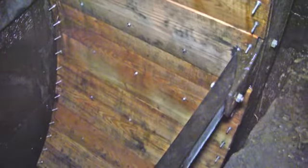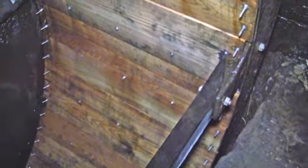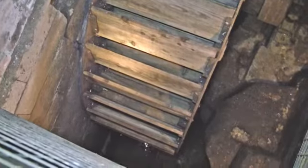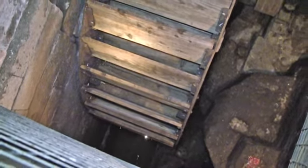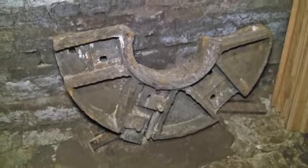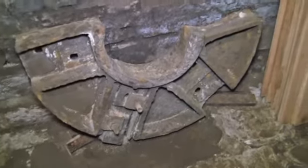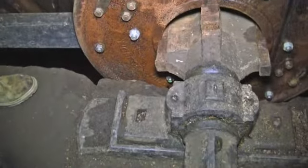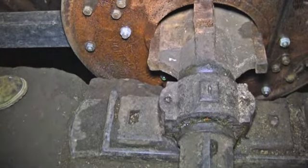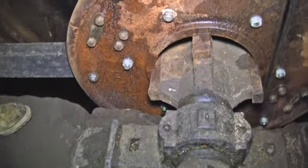From there we overhauled both sets of the mill wheels. This mill is quite unusual in that it's got two sets of wheels and they're linked — usually they'll be separate. We've replaced all of the wooden timbers in the wheels themselves, the spokes and the buckets. The naves, which are the cast iron hubs at the centres of the wheels, had broken so we had to have them recast. On the lower wheel we managed to retain the original but plate them up and keep them safe for another hundred years or so.